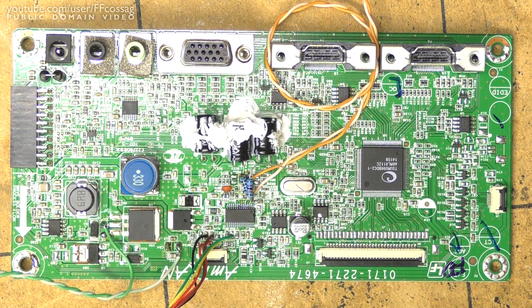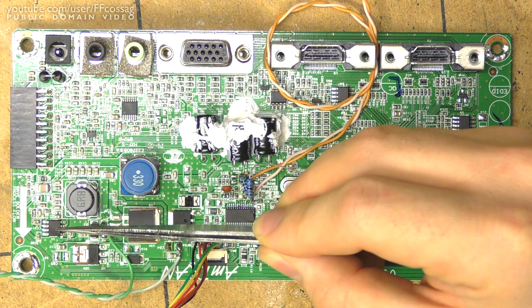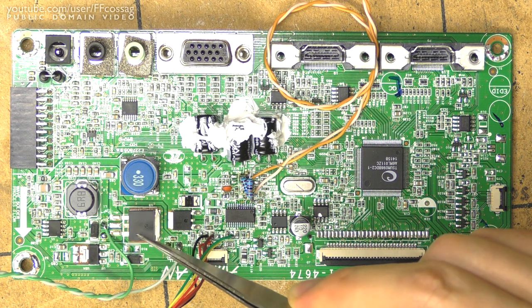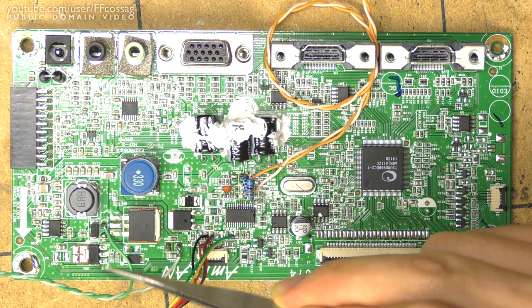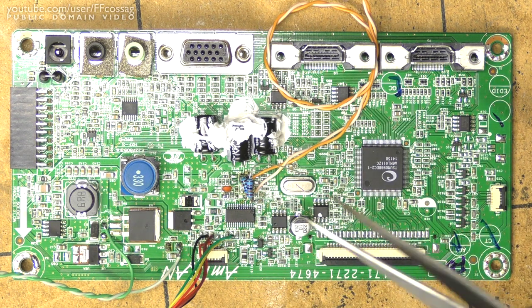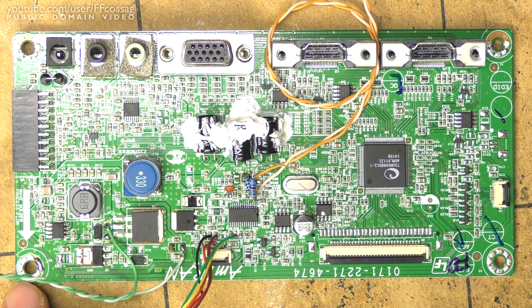Here's the modified ASUS monitor power supply slash mainboard. It obviously has a graphics processor already in place that is simply not being used — not being powered at all. This board runs with a DC 19V input. This here is a switching 5V regulator which I haven't been able to find a datasheet for, but I've tested it at about 1.2 amps and the BenQ motherboard draws about 1.2 amps, and it seems to be running just fine. Even after being powered for quite a while, nothing's running warm. I can imagine this is roughly a 2 to 2.5A regulator made to power everything in the monitor. After that regulator there's a giant linear 3.3V step-down as well as a 1.2V step-down to power the logic. I've just tapped the 5V output and a ground, running straight to the 5V input of the BenQ monitor.